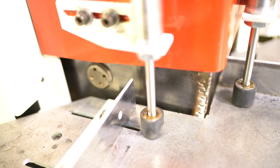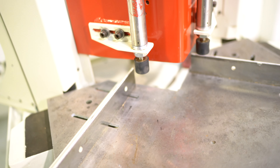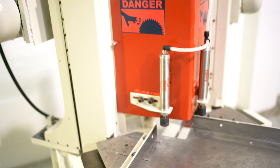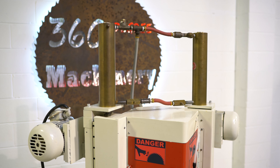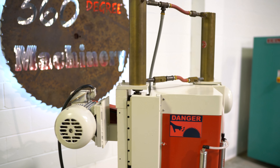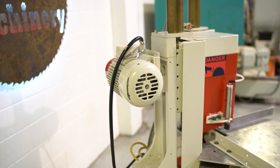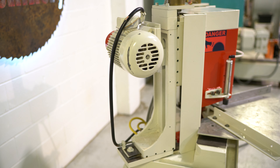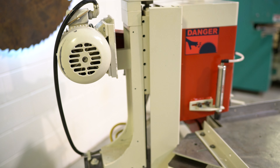You'll have 5 and 3/4 inches from there to the face of your blade. You can also set this up as a double miter saw. You can tell this is a 301 because the pistons are on the top. It does have staggered blades so it really does have a large cutting capacity. You gain everything since you do not have a pivot point — on a pivot you actually lose part of that blade, whereas these blades basically just drop down onto your material.